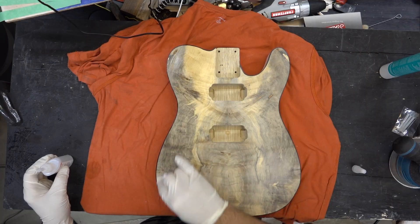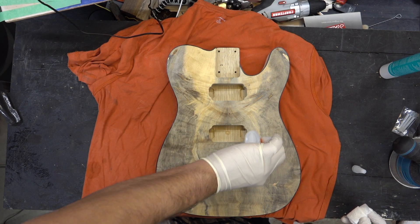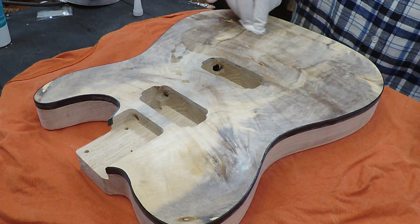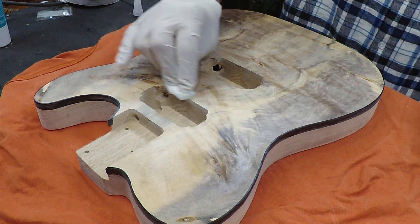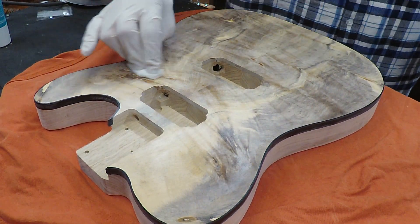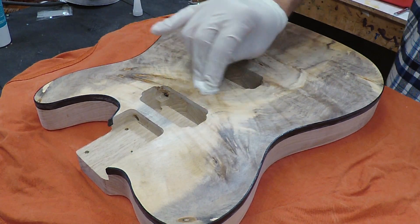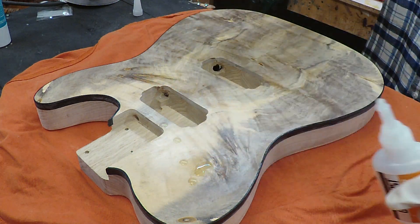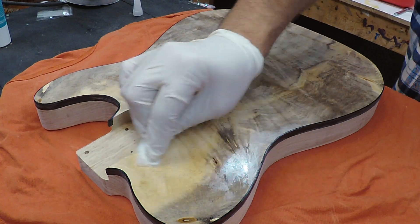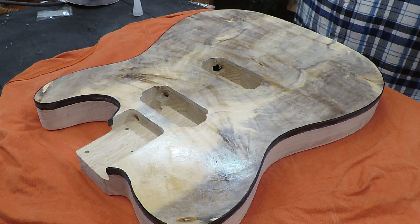This stuff moves a little bit better and it's a little bit glossier. I've got so many coats on already. It's got great workability — I can feel like I'm moving it along pretty good. It starts to get a little bit hard, but it's got great open time. No bubbles, stuff dries really hard. For spalt and burl like this, this is a really amazing finishing product — it builds really nicely. We'll hit this with the accelerator and put another coat on.